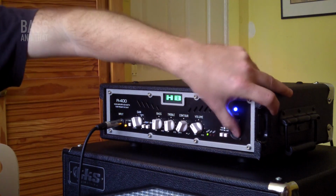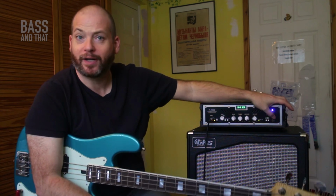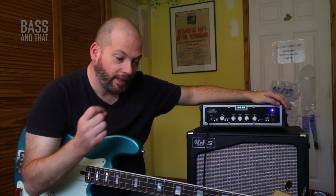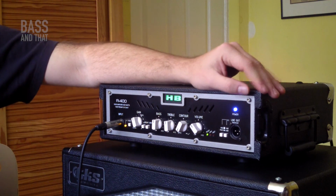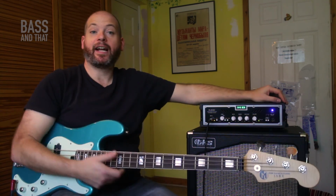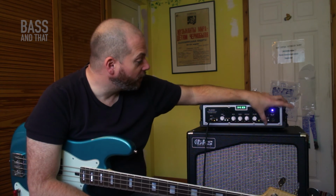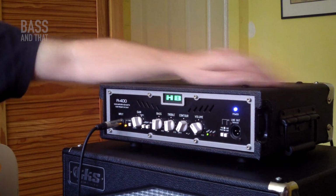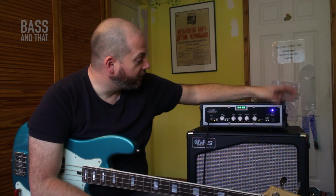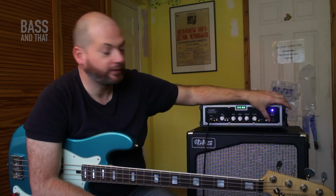You've got your pre-post. Oh, you've got a DI. Now the DI is from the transformer, which I believe is a really nice thing. I've used the DI quite a few times on the YouTube clips that I've got. You can get an idea of it on there, and also I've used it at pretty much every gig where I've needed a DI. So there are some pretty big gigs. The DI's just sounded absolutely beautiful. So you've got a pre-post DI switch here, so you can either take the DI straight from here, or after you've been through all of the EQ and everything, and you've got a 6 dB pad switch on the DI as well, if the signal getting to the desk is too hot.